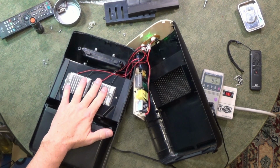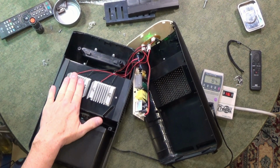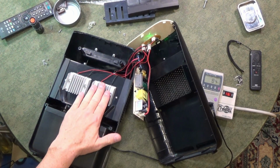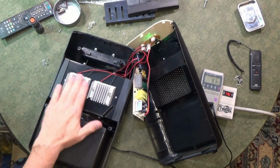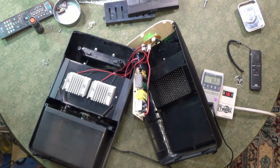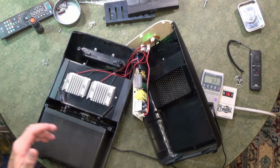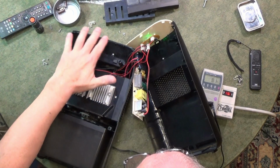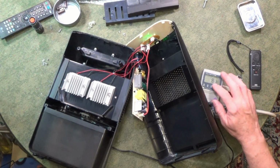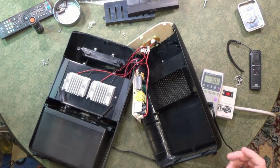Oh, and I can feel it getting cooler already. Oh yeah. Yep. On both sides. Ingenious. Well, I can't speak to how efficient these little units are compared to a full-size dehumidifier, but this will pull air across it, cool the air off, cause the air to lose its moisture, and send the air back out into the room. So, that's what a dehumidifier does, and this one's doing it again. I'm gonna turn it off, put it back together, and figure out what to do with it.